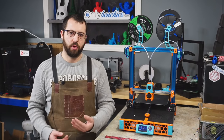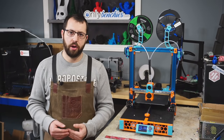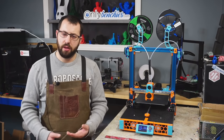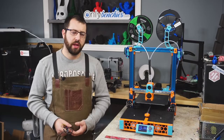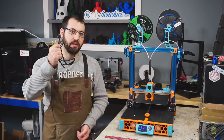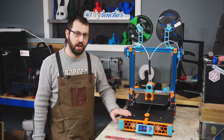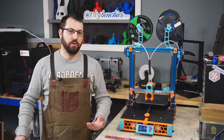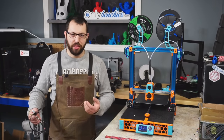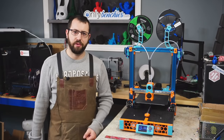The last print calibration you may want to do before moving into actual printing is a pressure advance tune — I have a separate video on my channel linked below on how to do a pressure advance tune with Klipper. There's a nifty little macro built in so it only really takes one print to do it correctly. Once that is done you can go ahead and start printing to your heart's content. There is one more cool feature that everyone wants to use Klipper for and that is input shaping — in the next video I'm going to show you how to slap an accelerometer on your tool head, hook that up to the Raspberry Pi, and cancel out ringing on your printer almost completely so you can run at crazy high acceleration rates, save a ton of print time, and still get amazing quality prints. Make sure you're subscribed so you don't miss that video, and if you like this one hit that like button. As always, be safe out there, wash your hands, and have yourself a great day — thank you.